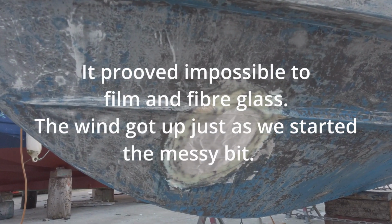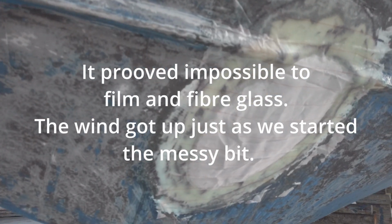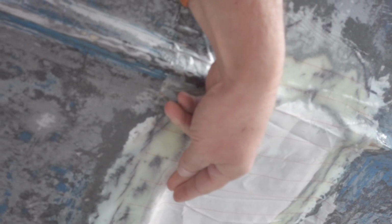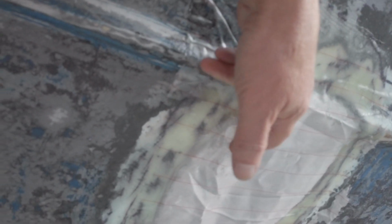On a brighter note, yesterday we did fiberglassing. We got all of this fiberglassed. It's all covered in peel ply now. So it's had thickened epoxy into where I've ground out, and then we've put two layers of biaxial over the top of that, a 300 grade biaxial, and then covered it in peel ply. What it's also had is another layer of biaxial around inside the ring, and that comes out to the outside. So there's three layers in total, but all in different directions.